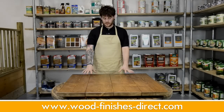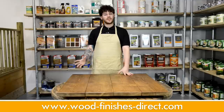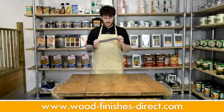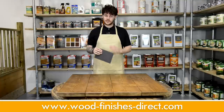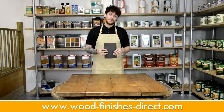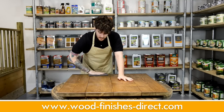I've let this dry for a few hours. The next step is de-nibbing, or giving the area a light sand. What I'm going to be doing that with today is a Manns finishing pad — it's kind of like a scotch pad. You can also do this with very fine sandpaper. Just don't apply too much pressure. This step really aids adhesion of further coats and also helps it level out. You just do it by lightly rubbing it down like so.